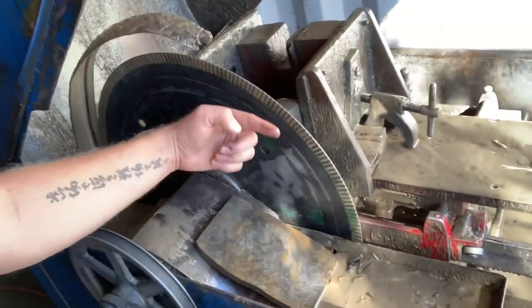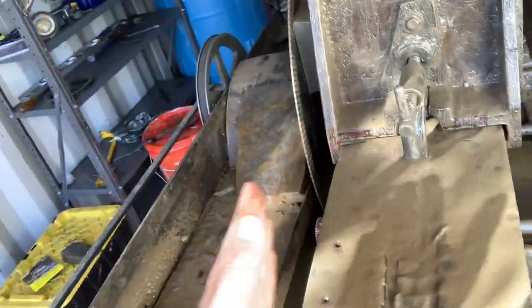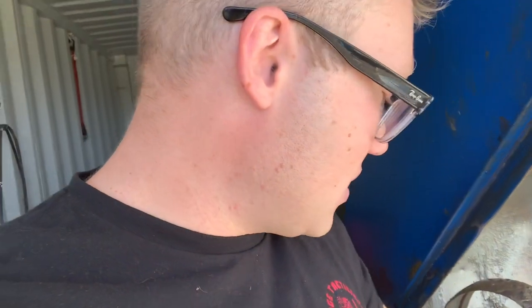And because I'd already made a previous couple of cuts before, and this carriage has a crossways system, see how the carriage actually, it's on this screw. So you can pull it over to adjust for how thick of a cut you want to make. And because you don't have to unclamp the stone and change the way you've gripped the rock, you can get really flat parallel cuts. Now, if you're cutting a hard stone like jasper, you need to cut slow.